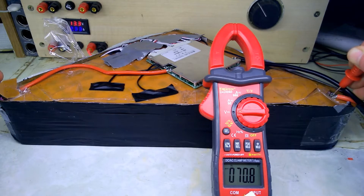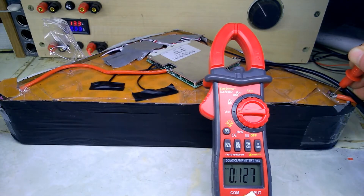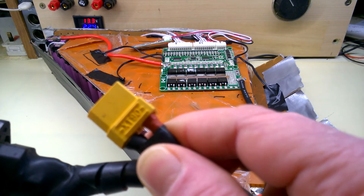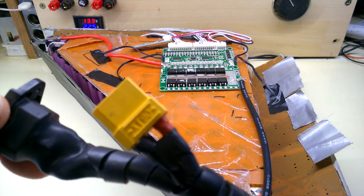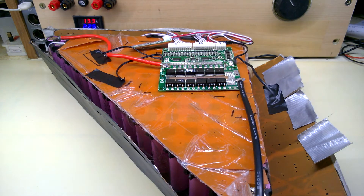So there's got to be something here that's dropping all the voltage. If I apply something like 80 volts DC across there — maximum of 84 — that should give me some idea if this is actually working as a charger. We know it doesn't work as a discharger. I've only got about 13 volts maximum available here, so I need to step it up to 80 volts.